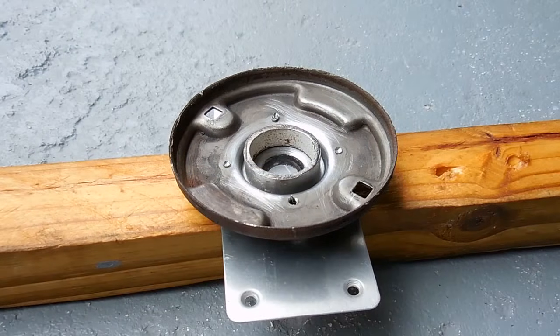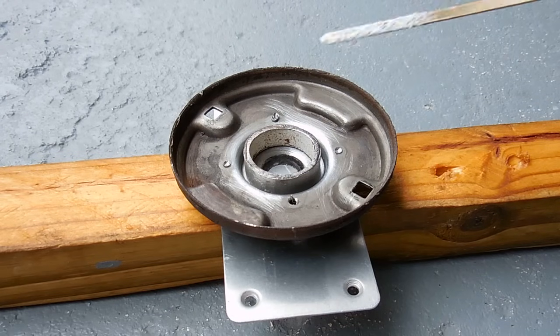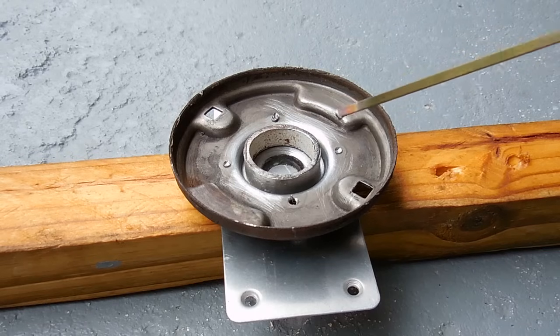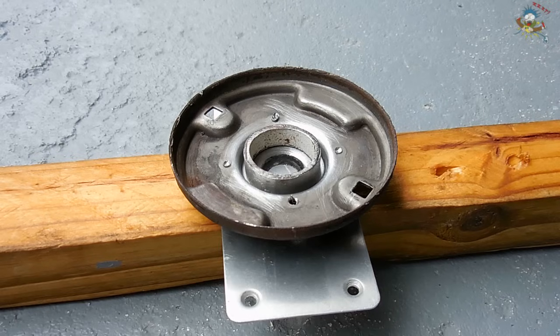The first thing I'm going to be doing is brazing the steel ring in the center to the steel plate on the outside. The steel ring is approximately 3/32nds of an inch thick, a little under an eighth of an inch, and the steel plate it's going to be brazed onto is approximately 1/16th of an inch thick. I'm going to be brazing on top of a damp piece of wood, which works extremely well. I'm also adding a piece of aluminum underneath the workpiece where the flame will be directed to prevent the wood from catching fire.